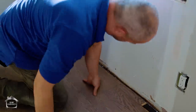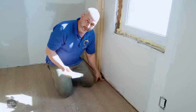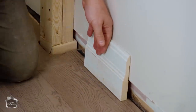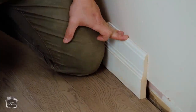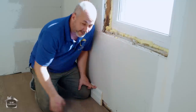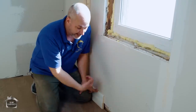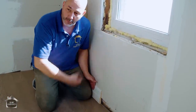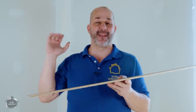Every floating floor is going to have a little bit of bounce in the last piece near the wall, and same near doorways. When you install your baseboard, don't work from way back — get right up close, put your weight on the floor, set in your base, and then attach it. You want your fastener through the baseboard into the wall, not through the floor — just get the base in nice contact with the floor. That pinning effect around the room gets rid of bounciness and prevents gaps from opening and closing over time.